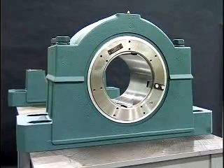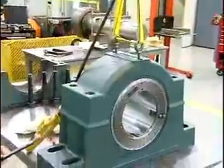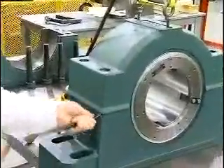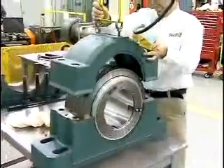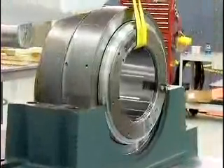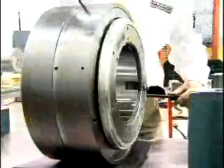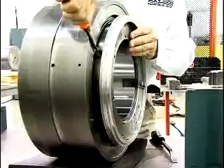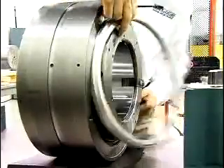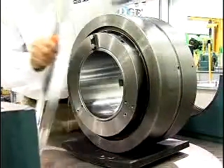If the inner unit is still within the pillow block housing, remove the top of the housing and lift out the inner unit. Now remove the lubricatable auxiliary seals or auxiliary seal and end cover from the outside diameter of the mount and dismount nuts. Be careful not to damage the O-rings in the seal bore. Note the orientation of the seals in the housing before removing.